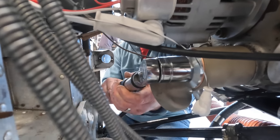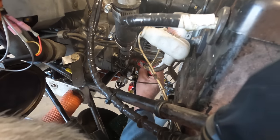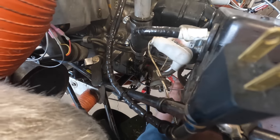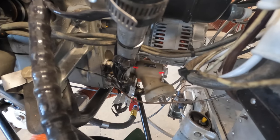Still bummed about those magnetos — nothing I can do. Side note: looking at the magnetos, there's 65 foot-pounds of torque which I'm holding. We'll just put a little lacquer line here, and if it moves it breaks that line of red, so you know it's loose and needs to be re-torqued. Then we wire it all up.